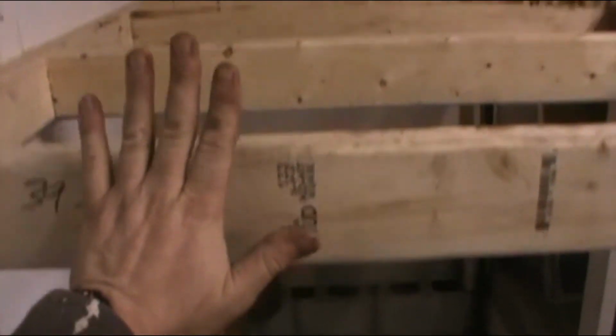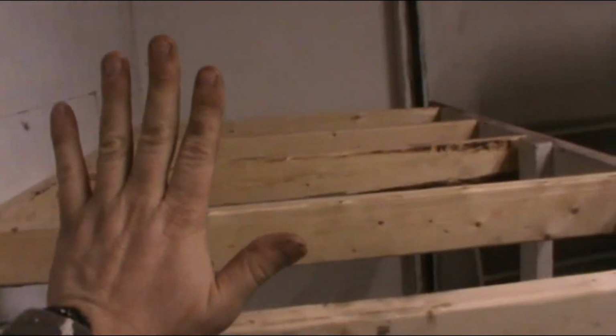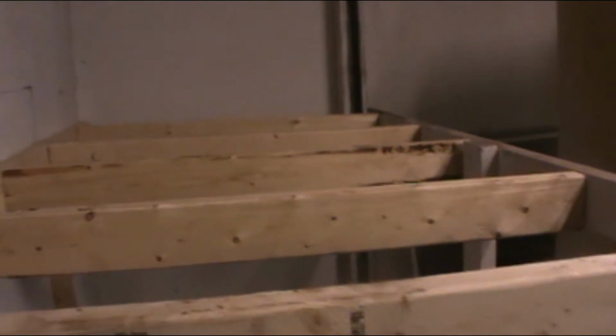And then here I'm gonna put a toe board that's gonna stick up, so I think that'll work out pretty nice. And then I'm gonna put a small handrail up here, so that way, you know, I don't want stuff falling down off this side. If it falls off that side, and we're gonna have a side to load it on, it won't be so bad. But if it falls off this side, it'll be bad, because there's the stairs. Alright, next step.